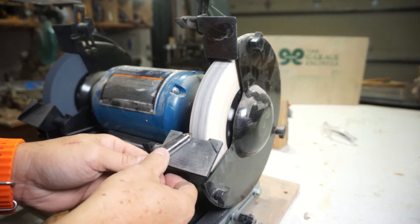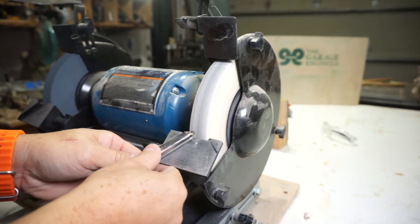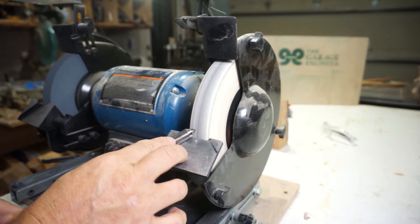Right now I've been using just basic turning tools. This is my bowl gouge — this is Benjamin Best, so it's a good beginner high speed steel bowl turning gouge. But the way I'm sharpening it is using a white aluminum oxide grinding wheel. It gets the tool sharp, but it takes an awful lot of material every time I grind. When you do woodturning, you've got to keep that tool sharp. And if you're not into woodturning, just wait — this video is not just about woodturning. There will be many facets of this product that can be used in other parts of woodworking, because I want something that's multipurpose. We're going to talk about sharpening chisels, sharpening knives, and woodturning tools.